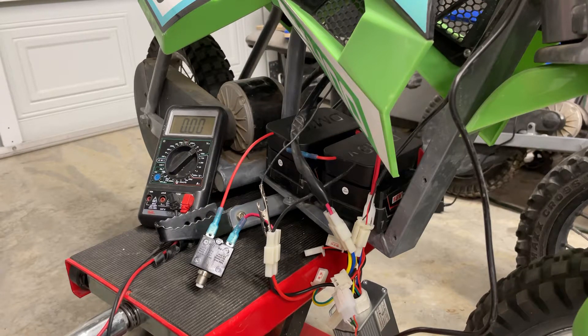I really like the idea of removable batteries, so that's why I wanted to put two on there. This bike is made for 24 volts typically, and putting two batteries will bump it up to 36 volts, so it's going to be really fast. As a result, I don't want my three-year-old going as fast as this will go — I needed to figure out a way to control the speed.